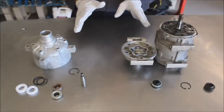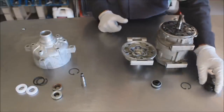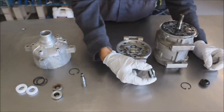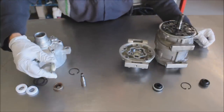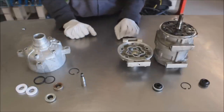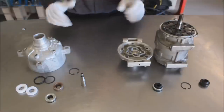The different types of shaft seals, being of the lip type, all work the same way, but they have a couple of notable differences. Some have a molded neoprene around the outer edge that seals it into the housing. Some have an O-ring that's on the seal itself. And in the case of most GM ones, the O-ring is not on the seal — it's actually installed into the compressor itself. So even though they all pretty much work the same way, there are slight differences, and there are so many different compressors that we could never cover every variation. It's something you just have to get apart and take a look at.